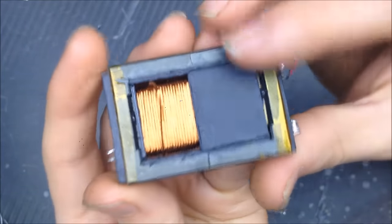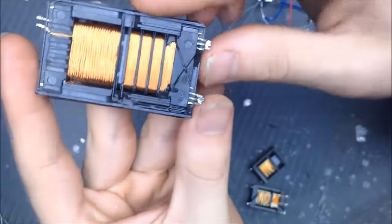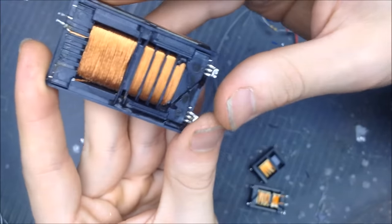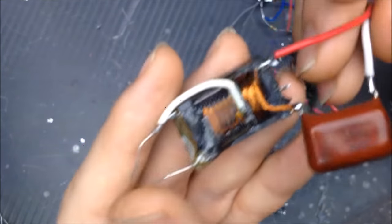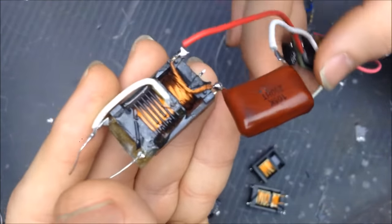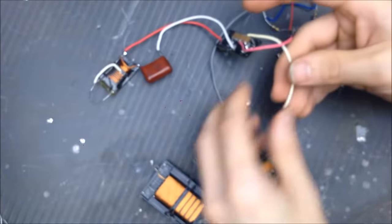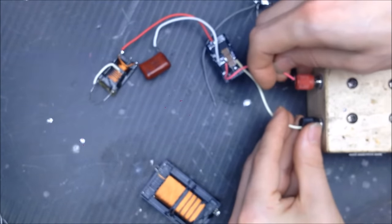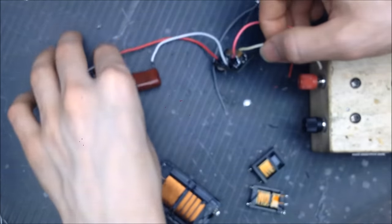Alright, so I got this high voltage transformer. Here's my primary that I've already cut here in the bottom. It's already wired up for about 40 volts input on here, and it's a full bridge configuration. So, we've got something that's wired up similar to this little guy right here. This is another full bridge configuration. Two wires and then a coupling capacitor right here. So you only need two wires to run this type of configuration. So I'll show you. Works really easy, but it's not ZVS.